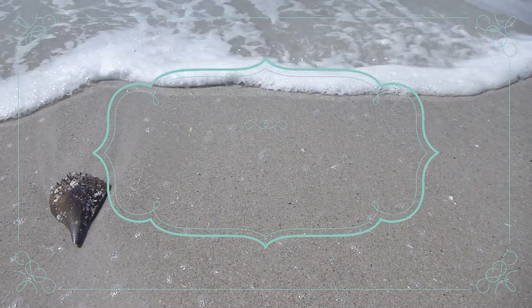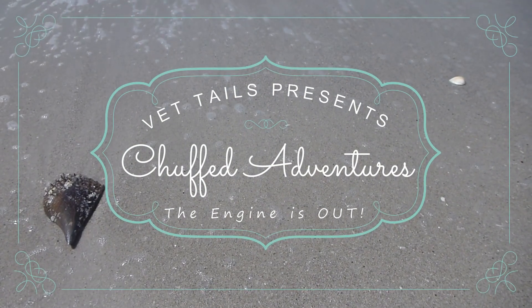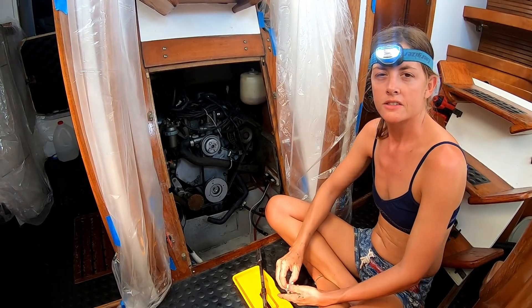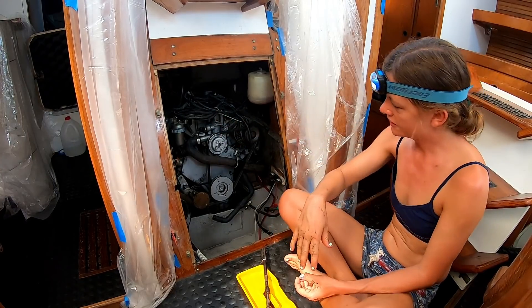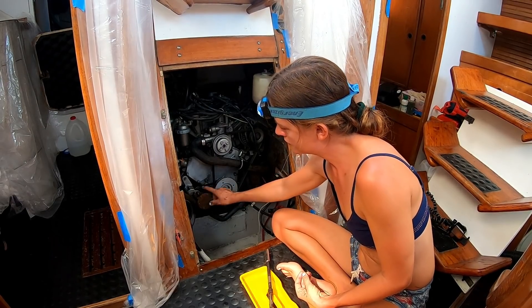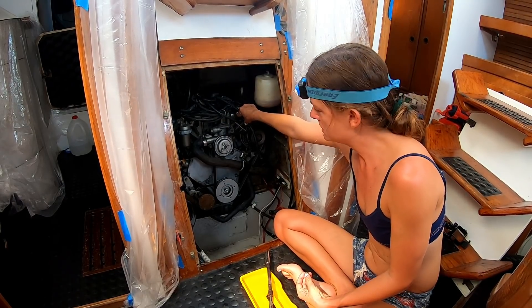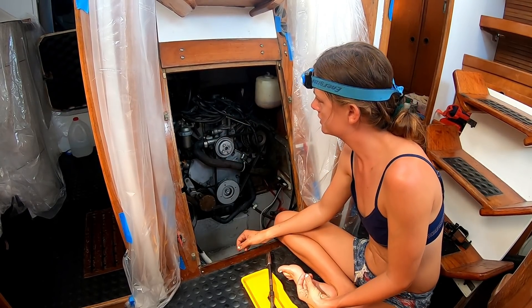Alright, we're off for round two of the vaccine campaign. It's very sad. So, to begin with, we've taken the electrical connections all off, batteries are out, and now I'm just draining the fluids from the engine to make it lighter. And then we're going to take these auxiliary parts off. So I've just started taking the salt water pump off, we'll take the alternator off, we'll probably look at disconnecting the transmission, and that way the engine will be as light as possible and as easy to lift out — and take all the belts and pipes off, obviously. So, that's kind of what we're working on now.